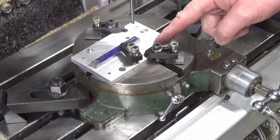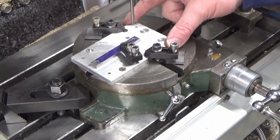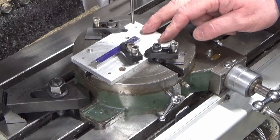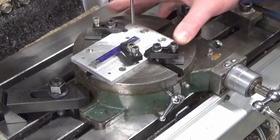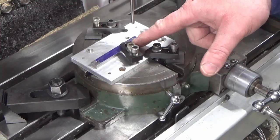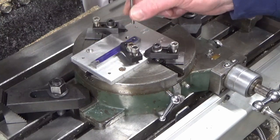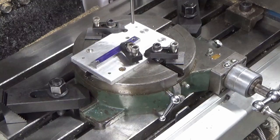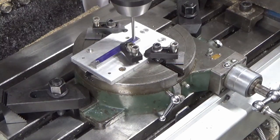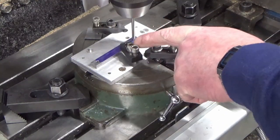Right guys, excuse the noise, I've got my heater on, that's what the noise is. So I've got my little fixture plate up on the rotary table. We've got that clamped down with a couple of clamps. We've put our Conrod up. I've got a piece of drill rod, or high speed steel, silver steel, ground to 4mm diameter in the 4mm reamed hole. And basically what we've done is we've dropped that in to line the part up, and used another clamp to clamp the part.